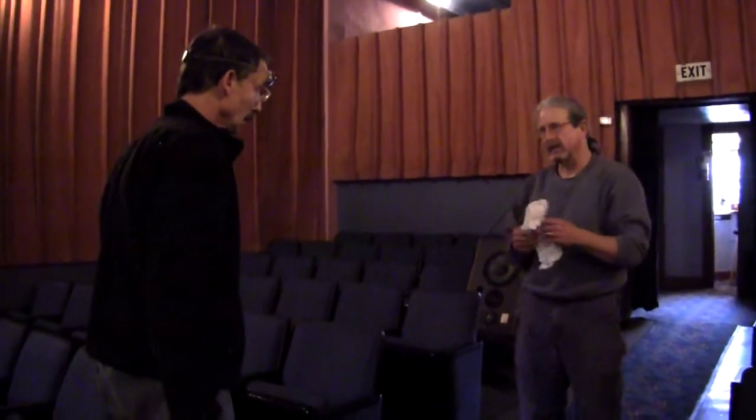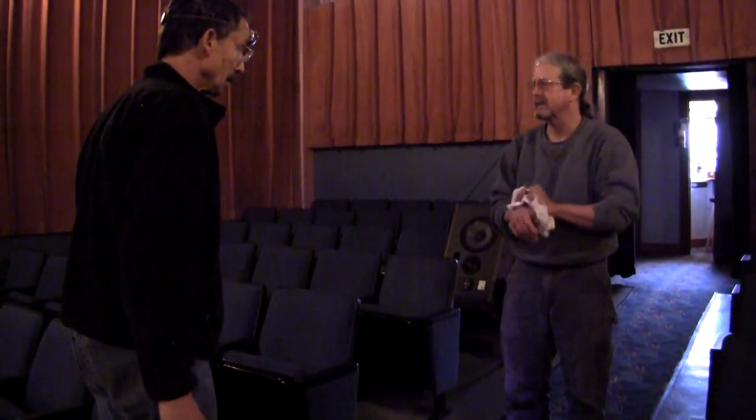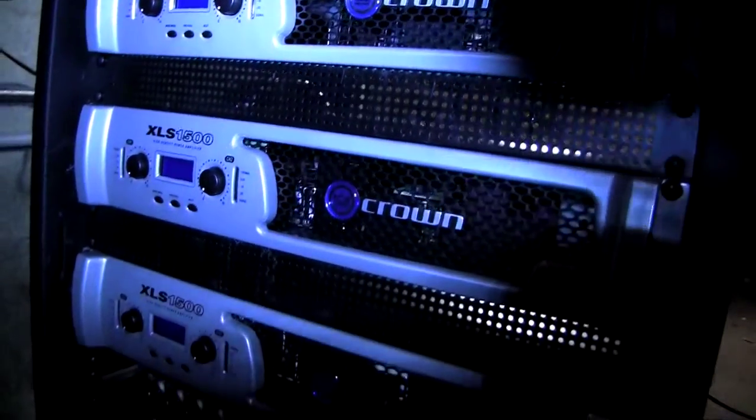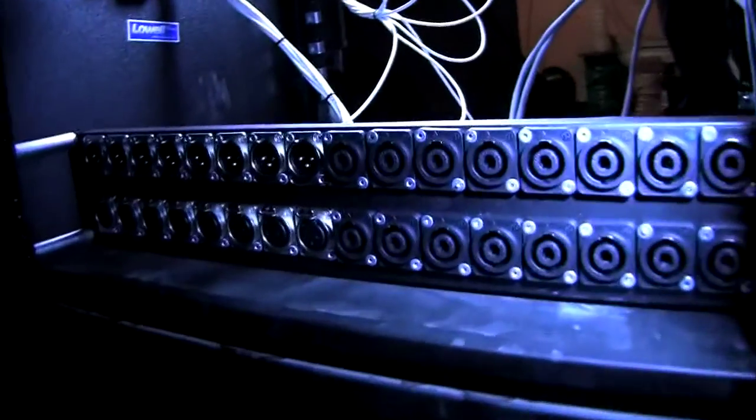I've got some 10-gauge wire that I'd like to pull from the breaker panel and just make it all good, because it starts out being 14 gauge. Whole new set of amps. New amplifiers, new wire, new just about everything up here. The old QSC is still going to run in mono bridge — 1500 watts into two ohms per channel and 14 pounds. So if he has an amp channel going down, he can patch around it because we have one spare channel in this rig.